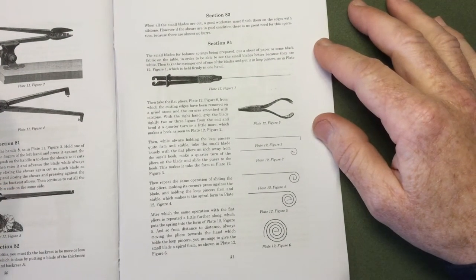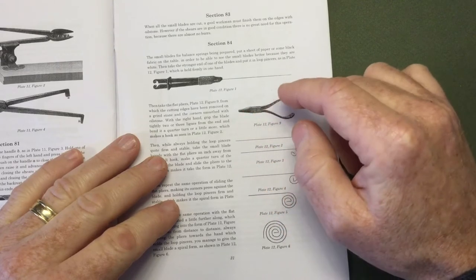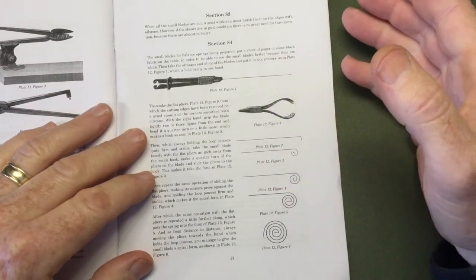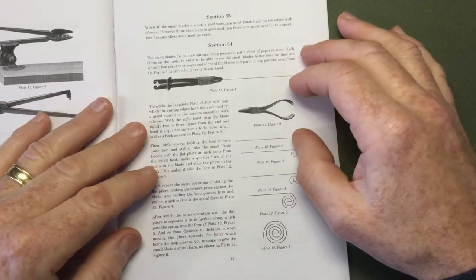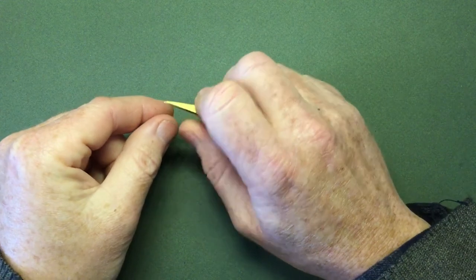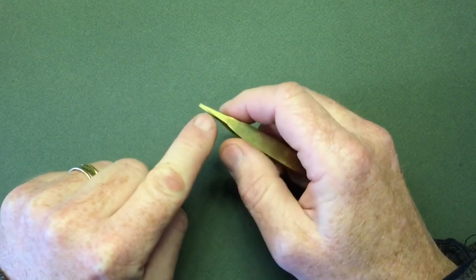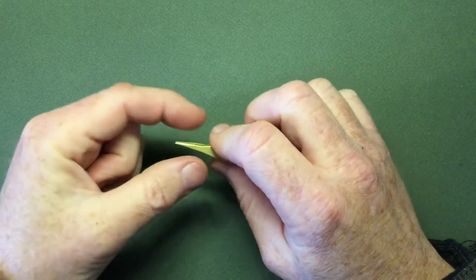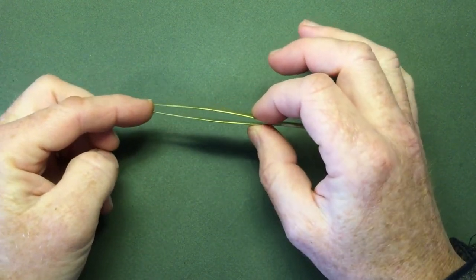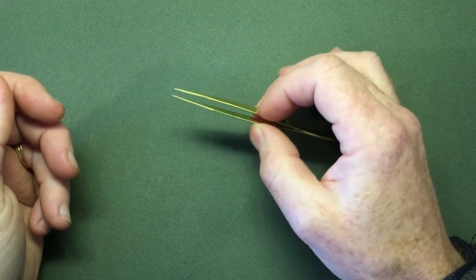So going back to Blakey's book from the 1700s on making your hairsprings from scratch — he's got a little pair of pliers. As I said in the past, I don't have a pair of pliers like this, and it would be a fair bit of work buying an established pair and trimming them down or smoothing and grinding. So I decided to try a pair of brass tweezers that I made a couple of years ago. Nipping with the ends of the tweezers and drawing through actually gave some promising results, despite me not checking the edges of the jaws which were a bit sharp and not designed for curling hairsprings. But that gave me encouragement to try and bring an amalgam of the pliers that Blakey uses and the tweezers that I can make fairly easily at home.